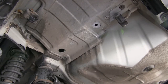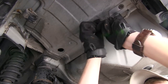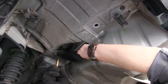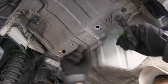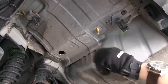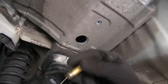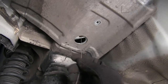Now we can get ready to install our hardware. We'll grab our fish wire and start by feeding this end through the smaller hole, coming out the larger hole. Then we'll take our block, fit that over, and take our carriage bolt and thread that on. We'll feed that block up through first, followed by our carriage bolt, and guide it all the way over and bring it down. Then we'll do the reverse pull-through method — put the block on first, then thread on our carriage bolt, put the carriage bolt through first, then the block, and pull it down.